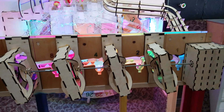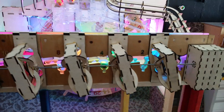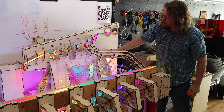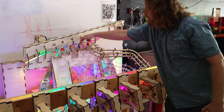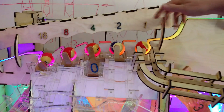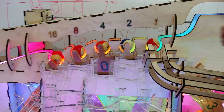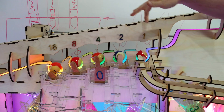And one plus one, or three plus one, carries again and we get four. So the other cool part of this is up here we have an input wheel. There are little knobs here that block these five bits, and the maximum number this will input in five bits is 31, which is 16 plus eight plus four plus two plus one.